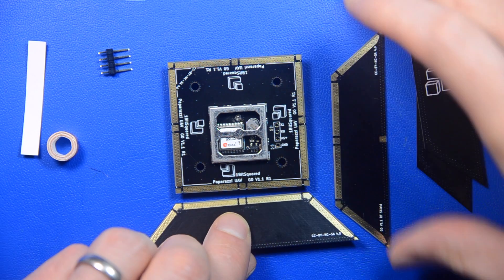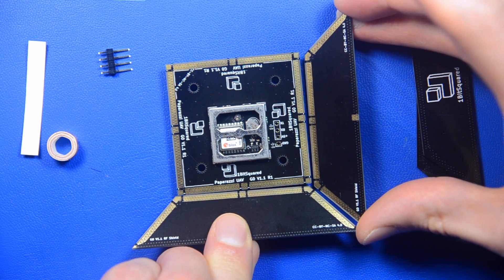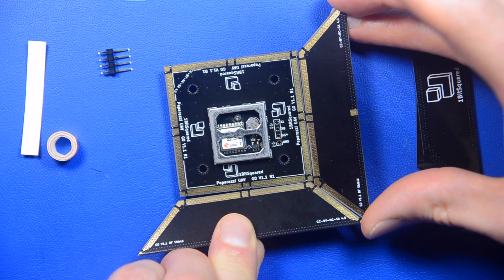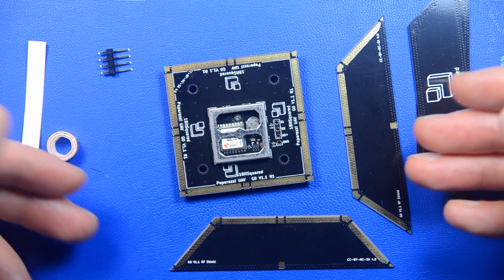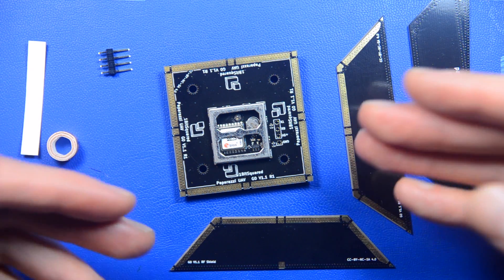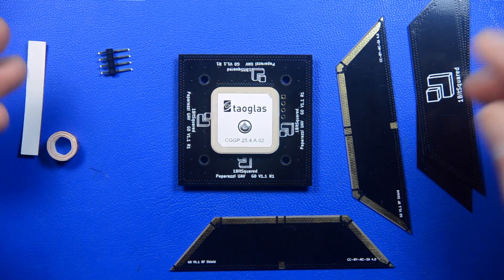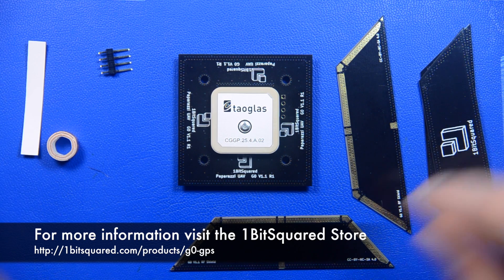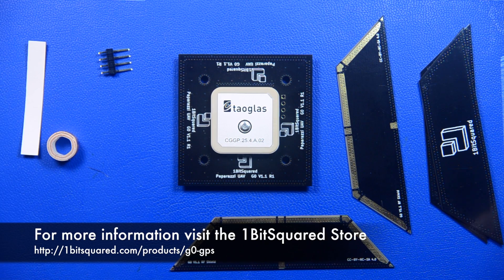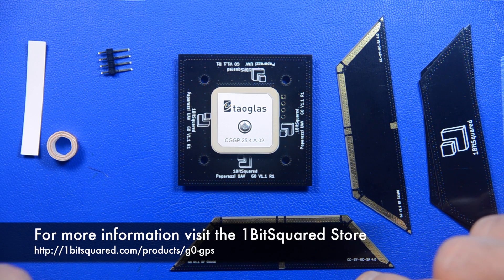When you put it all together, you get a cone with 30-degree angles that has a good mechanical connection, good ground connection, good RF shielding, and good directionality of the whole system. I hope you like it — I think this is quite a unique solution for GPS operations in robotic applications. Thank you for listening and have a good one. Bye!